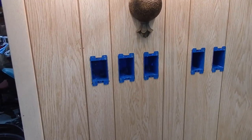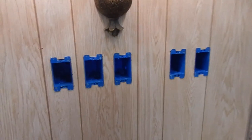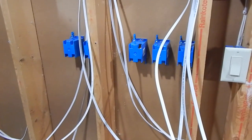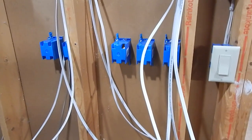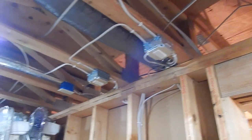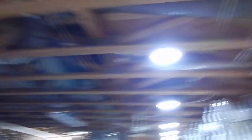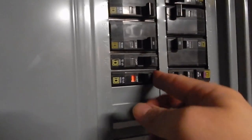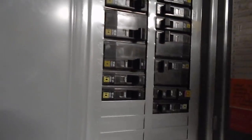I've been making some progress here — I'm not going to have time to finish this end tonight, but I do have the boxes in the wall. On the other side I have pretty much all the wires run down, so it's really just stripping them back, stuffing them in the boxes, and making up the boxes to finish this off. Up above I have my disconnects in, and that means power is fed all the way down to the other end now. I got my breaker put into the panel, so I'm going to go ahead and turn this on — hopefully nothing blows up. Looking good.